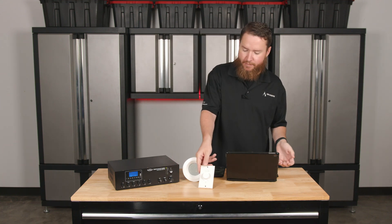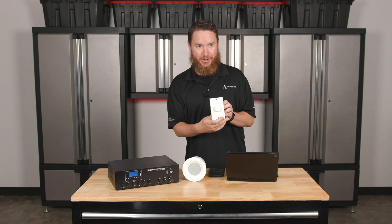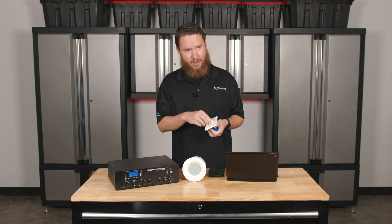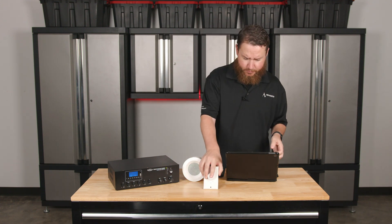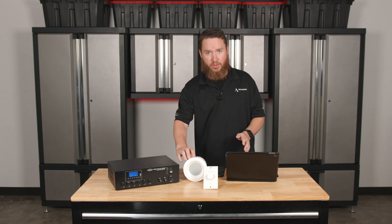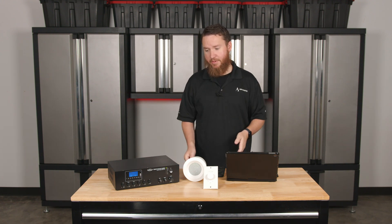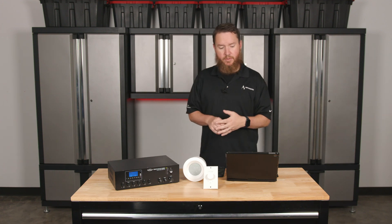At this point, we may also have volume controls tied in. Is the volume control right side up? Because if the volume control is installed the wrong way, it may not be on the position where you think it is, since there is an off position on almost all 70 volt volume controls. So first we just want to look at everything. We want to make sure we have good connections on the Euro blocks on the speakers, because if you just get signal to the first speaker in line and aren't hearing any further, maybe that connection didn't happen somewhere down the line. Visual inspection first to double check everything, which leads us to our next step.